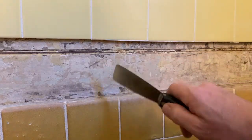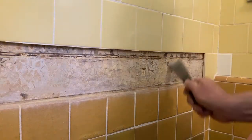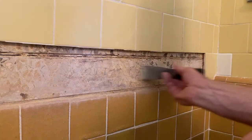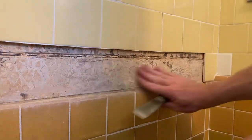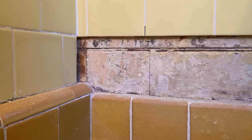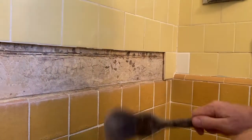It's pretty clean now. Here's this crosshatch technique. This also encourages any loose stuff to just kind of have the opportunity to come off. One more time in the other direction. It feels nice and rough — that's what you want. Starting to feel pretty good about this. So now I take a brush — an old paint brush. I call this my penalty brush. You can go really fast, kind of create a lot of wind that will suck any dust out of here. Because nothing sticks to dust.